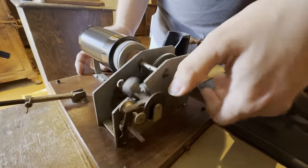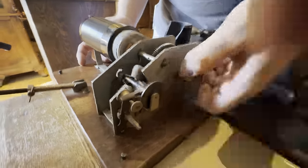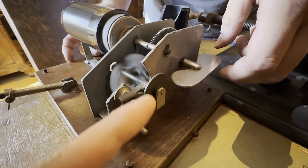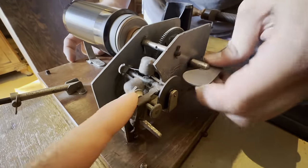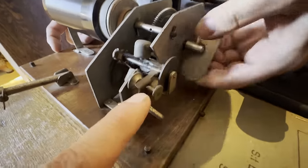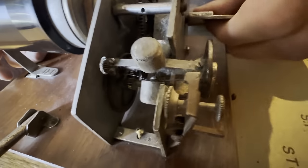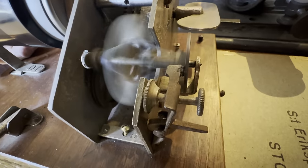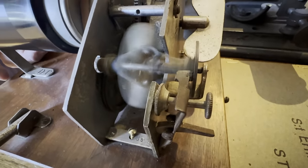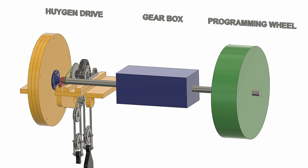I can improve by increasing the moment of inertia of the flywheel and by stabilizing the temperature of the grease in the bearings. To improve even further, I will need to look into building a better governor. The next step will be to look into using a fly ball governor to see if it can stabilize the tempo better than the air governor can. All in all, this design is just absolutely awesome and it is going to be the foundation for the marble machine. I'm really happy about it.